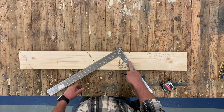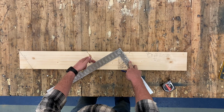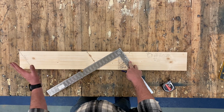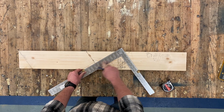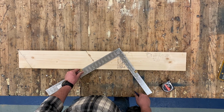So that's always gonna be one of two numbers, all right? It's gonna be 8 or 8.5, one of those. And if you wanted to do 8.5, you'd pull it back to here. So if your walls didn't have sheeting on them, you'd pull it back to 8.5. If your walls have sheeting on them, you put it on 8. Most people have sheeting on their walls beforehand.